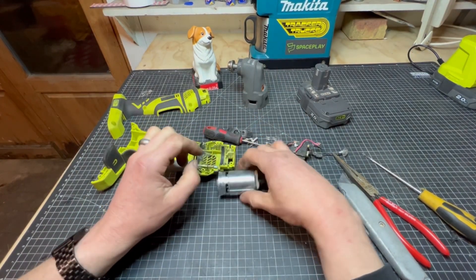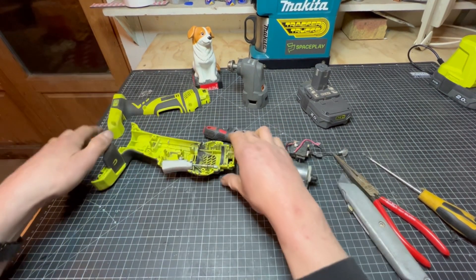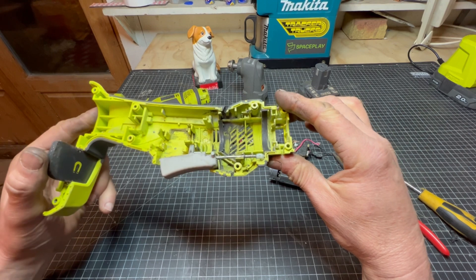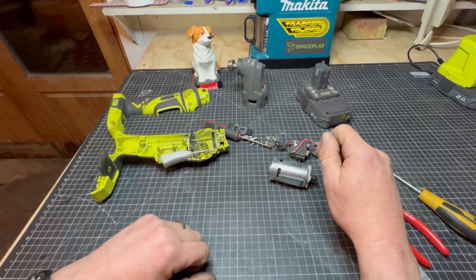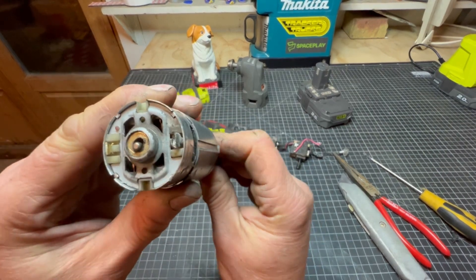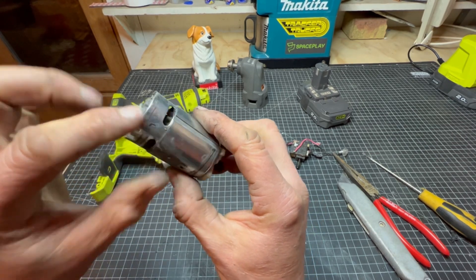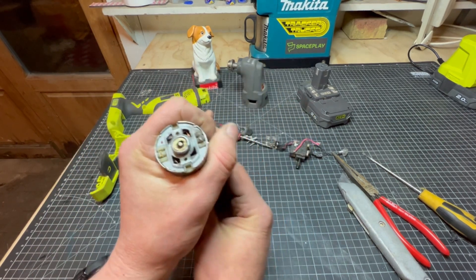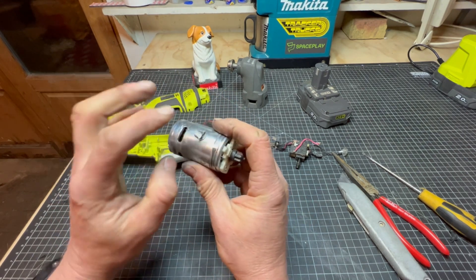I think I've found out what it is. Looking at the inside of the clamshell, you can see it's actually printed in when this tool was made - February 2019, so it's a pretty new tool. The failure is there - look at the play on the spindle. There should be a bearing at the back to hold the spindle dead centre, but as you can see it's kind of collapsed. So we're gonna have to go on eBay and get a new motor.